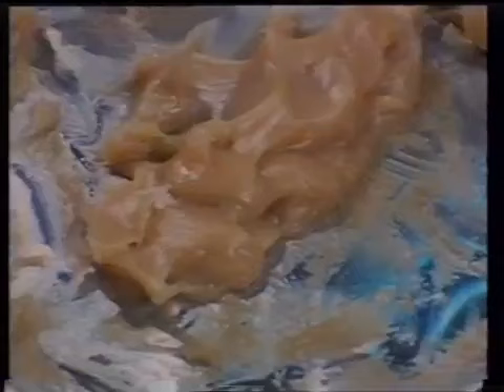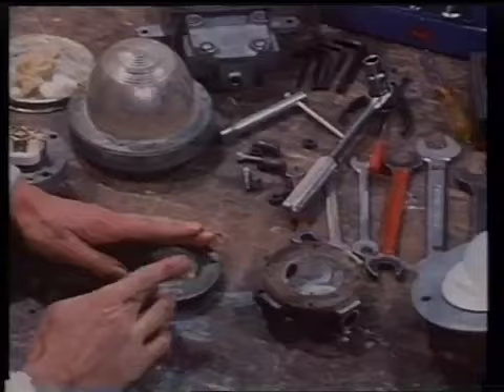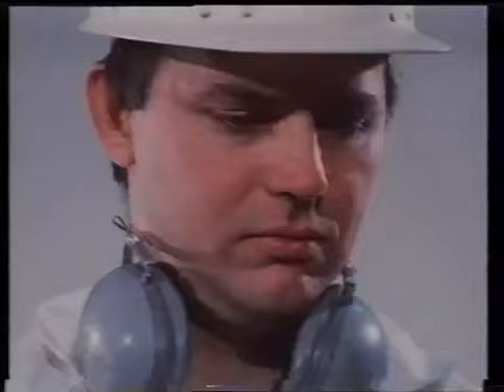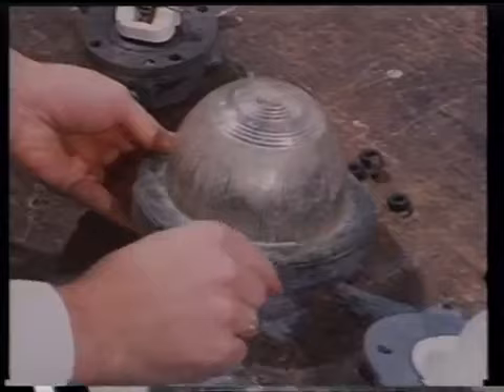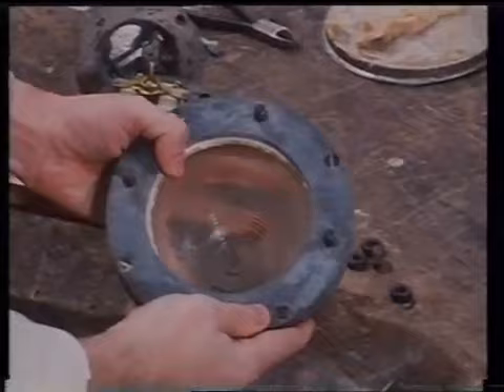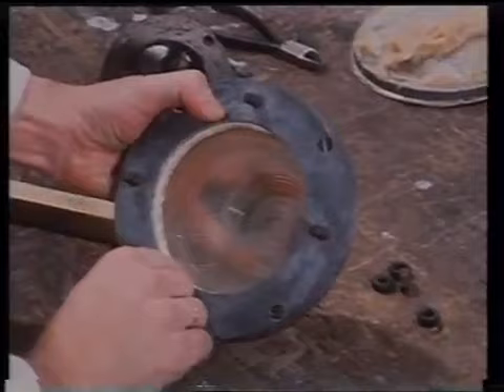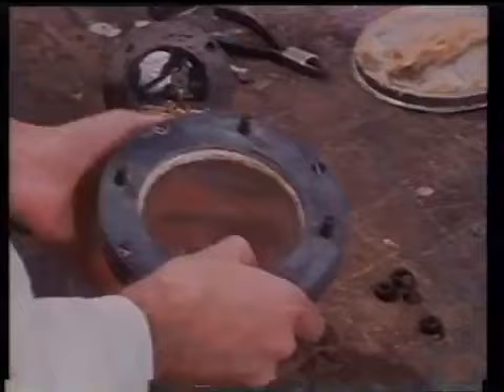Use only non-abrasive materials for cleaning. Lightly grease, then wipe clean the flanges before fitting them together. Periodic maintenance inspection and cleaning will necessitate the inspection of all flanges, glassware, and cementing to ensure that they are within the certified safety level. If either the cementing or the glass envelope appear damaged, do not try to mend or replace either. The whole fitting has to be replaced by a new part obtained from the manufacturer.